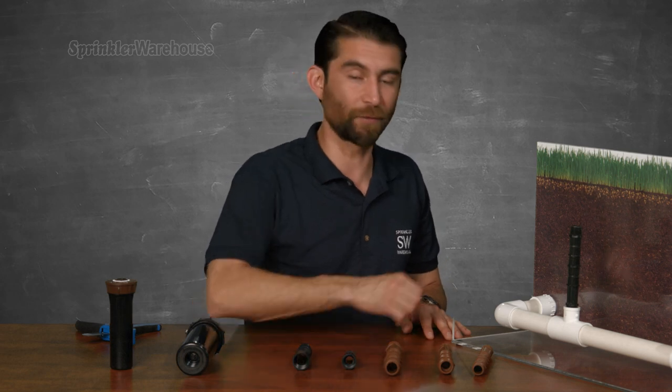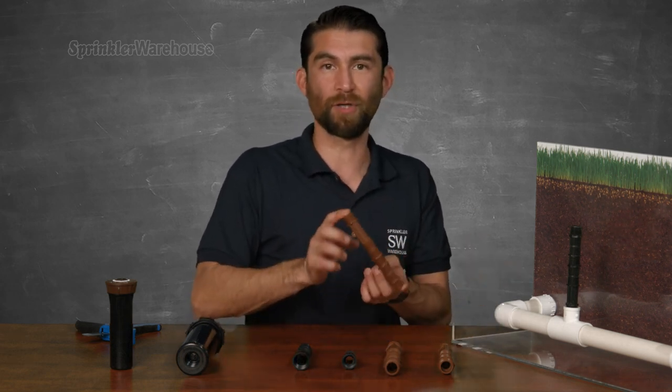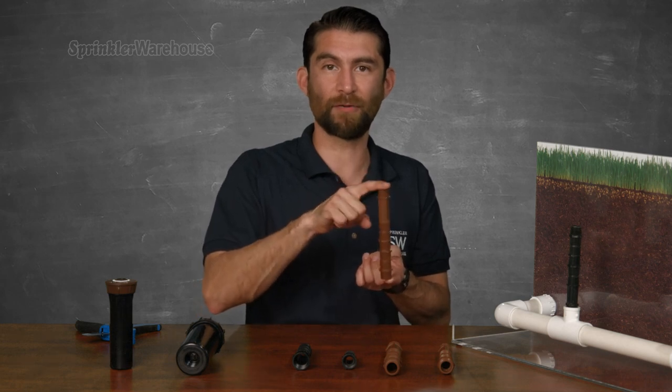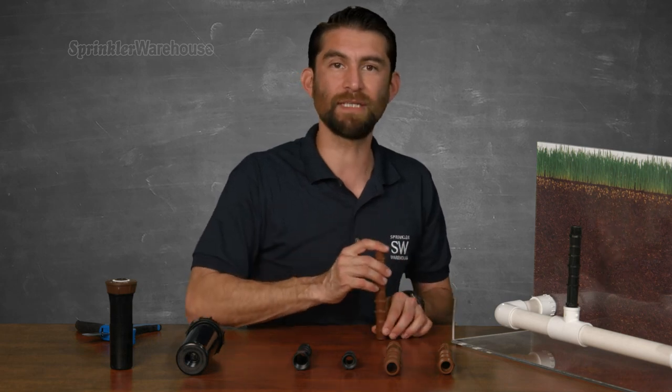This nipple riser I have in front of me is about six inches long. One threaded portion will go inside of the sprinkler and the other threaded portion will go into the top of the tee on your piping. Most tees have about a seven-eighths inch riser on them, so this cut-off nipple as-is will give you just a bit over a six inch rise off your piping.